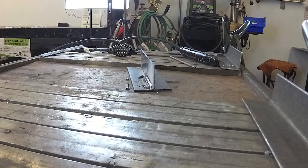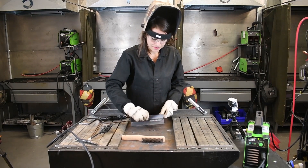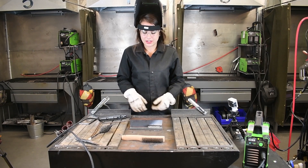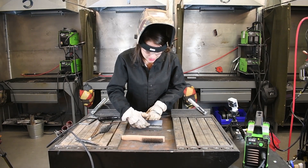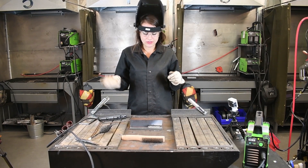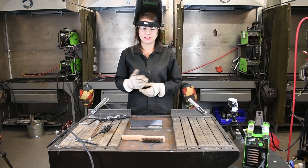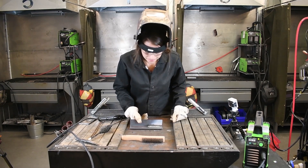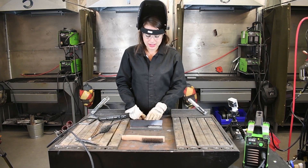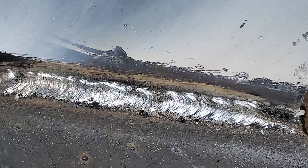Then we'll come in here and clean it up with this brush, and you'll have a really nice weld on your material. One thing to remember: if you're going to weld right next to or add on to this weld, make sure it's real clean and that you've removed all the slag. If you try to weld back over slag, it does pull some of it out, but you can get contamination — and if you're doing anything critical, you can cause cracking in your welds. For this small machine welding two different thicknesses, that's actually a really good tie-in. It lays in there real flat and nice.